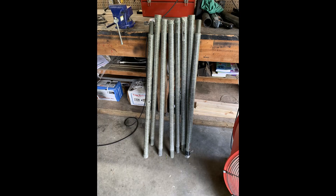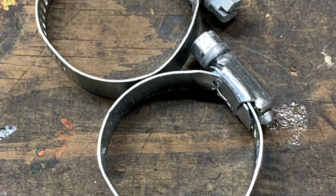I am using eight four-foot sections of military surplus fiberglass poles for the mast of the antenna. I will use this thin cable as guide wires connected to these turnbuckles to connect it to the anchor in the ground. I'm using two hose clamps to connect the guide wires to the mast.